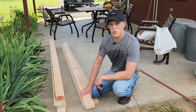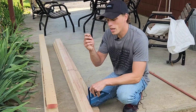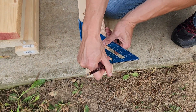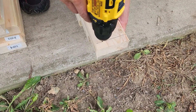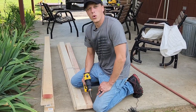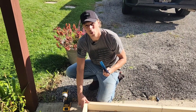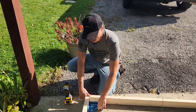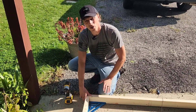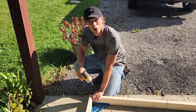We picked up some two-by-fours at the box store today and brought them to the farm. What we're going to be doing right now is using the speed square and a pencil to mark where we're drilling. You want to drill pilot holes so you don't blow out your wood when you go to put in the screw. We're using butt joints — nothing crazy, just something simple that'll hold together well. I'm using three-and-a-half inch screws that are rated for outdoor use.